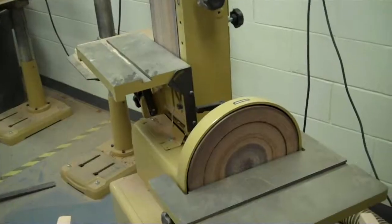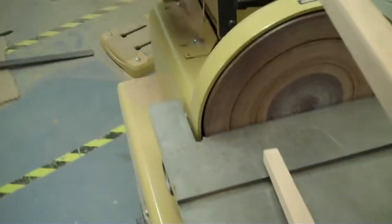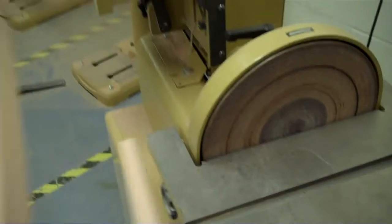This table, again, it's sitting pretty perfect, but yours might have some wobble, and I can help you get rid of that wobble. Okay, now if it did need to be sanded, you can come over to this disc sander here, and I would just bump the little leg into the side of the disc sander, whichever ones are too long, and go very, very gentle on this. Don't want to press very hard, and we'll just get it till it sits nice and flat.